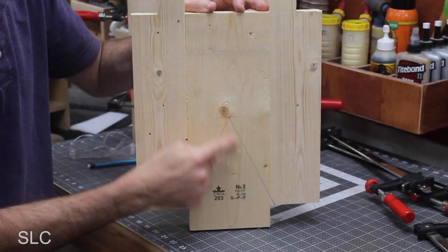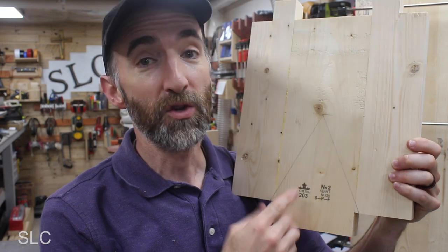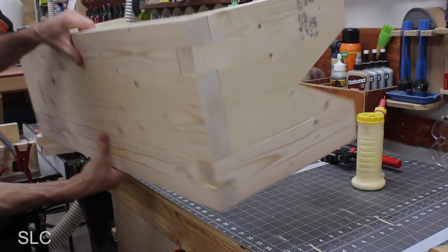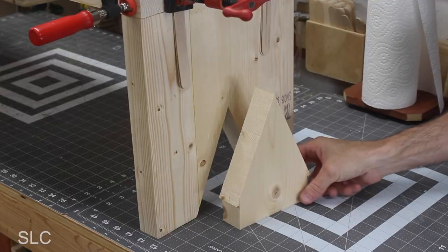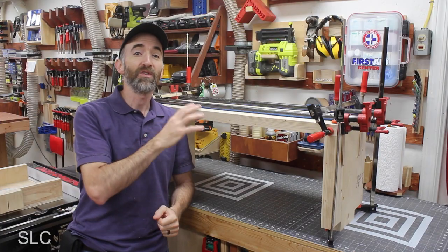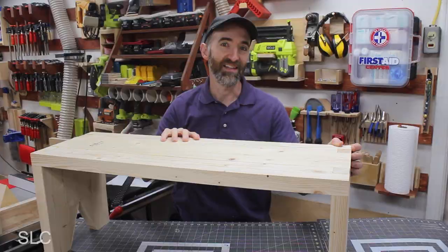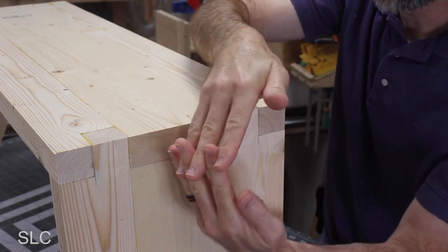After giving a leg some time to dry, I drew a triangle right here so that way it'll eliminate this excess piece and give it a nice little design. I'm going to use a band saw to cut this out, but you can use a jigsaw or even a handsaw. Now it's time to glue it all together. And to make sure the glue bond is as strong as possible, I gave this several hours to dry. With the clamps finally off this bench, it feels super sturdy, and I have a strong feeling that is primarily due to the finger joints. These finger joints allow for a lot of contact area in between these boards, which allows for a lot of strength and limits any kind of twisting and movement.